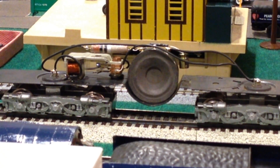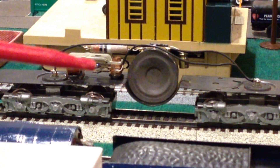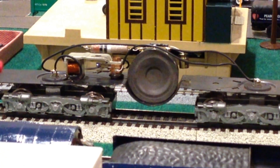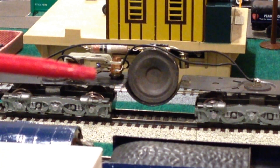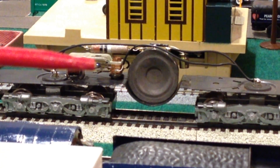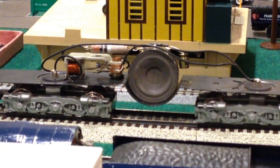There's the diesel roar being emitted out of the speaker. You can see the first set of points sparking — they do that on all of them — it's actually flexing down and hitting the second point, then being pulled back up to the top. You can hear that it has a nice rumble sound to it. Previously that was a kind of high-pitched, annoying constant buzzing noise. And here's what it sounds like with the horn.